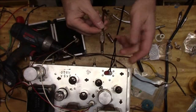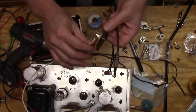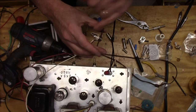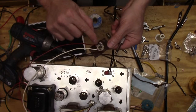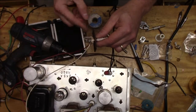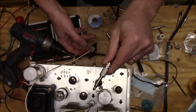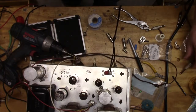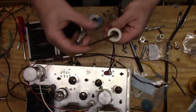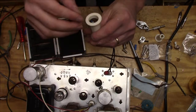Okay, so I soldered these guys onto the end, and then here I have a jack, usually used for input, but that shorts across here to here. So I jumpered here to here and have my input here. And then when I put this in, then it opens up, we should get sound. It should work the same way as that other one, but I think it's going to work a lot better. And I like having this for a speaker instead of that RCA jack anyway. And then the little plugs that go into the speakers, I drilled those out, and so then you can put that like that, and that should fit into the speaker just fine.